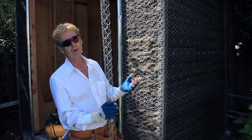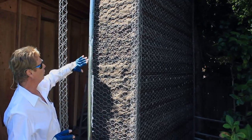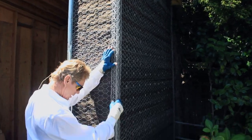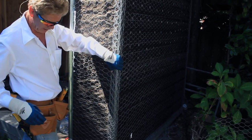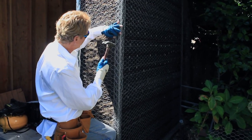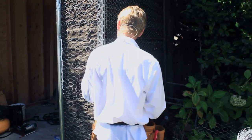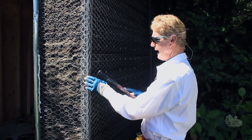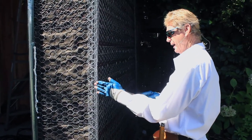This corner looks straight, nice and pretty, but it's a little bit off because it has to be flush with this one — this one here is out an inch, so this has to be out an inch too. I put this one on here: this is flat, this is a half inch, and I'll adjust for the other half inch. Put that right there — you could use a compressor gun, but it's too much to set up. You can use nails too, just roofing nails. I'd put them every six inches. Now this aligns with this, so when the stucco is placed here it'll be one inch thick.